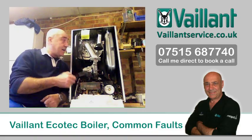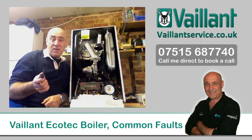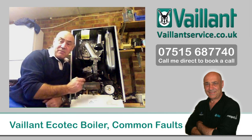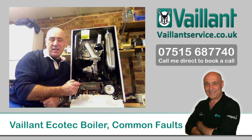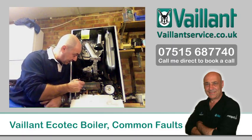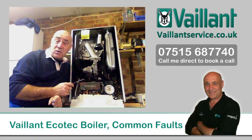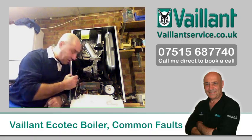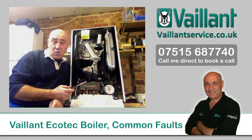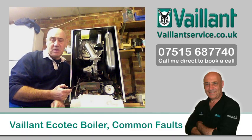Quick roundup: expansion vessel needs charging regularly — always get it done. Second, pump — may or may not fail, but if it does it should be replaced with the Grundfoss; grey face or black face tells you which you've got. Next, divertor valves have a tendency to leak. Next, hydro block and sensor — make sure the sensor is the third modified version and changed; make sure the hydro block filter is clear and clean. Finally, rubber hoses — check and replace as required, or at minimum rinse and clean thoroughly.